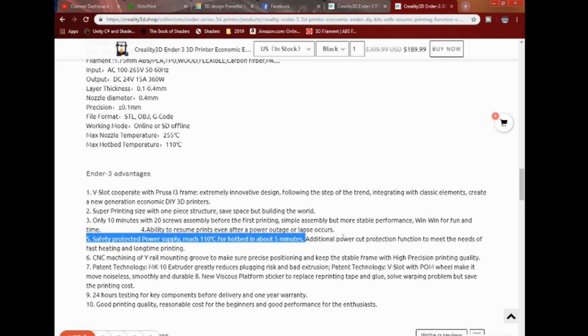Now, anybody who has owned an Ender 3 and has shut their printer off at night and come back on a cold morning to fire up their Ender 3 and noticed something called a min temp error can tell you that this error does occur. What a min temp error is, it keeps the printer from turning on basically if the temperature is too low, because the most common reading for a faulty thermistor is a low reading. It's not going to say it's 140 degrees.